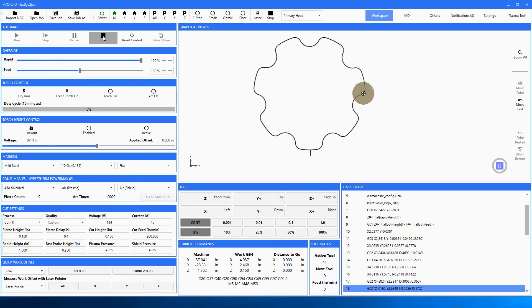We could now say 'Run' and we're off to the races. That is literally all there is to jobs. Just remember: it doesn't reset, it doesn't erase your original program, it doesn't change any factory settings. It just groups both of those items into a single file, and if you change anything it's isolated to that file only. This will be a great time saver for you in the future. Thank you for watching, happy cutting, and have a great day.